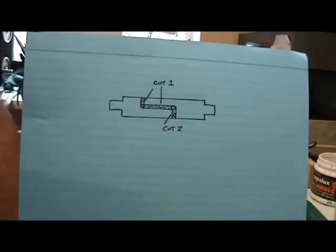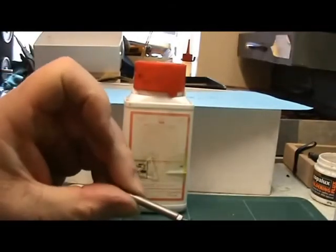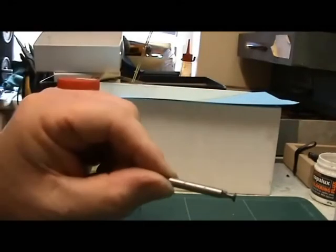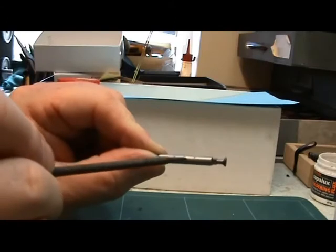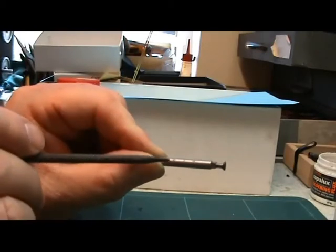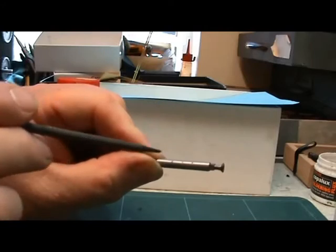Leave it to dry, then tidy up the whole thing, getting rid of any extraneous glue that might have wandered out of these holes. I'll show you how to do that later in the process. The first job is to get ourselves an axle and mark it up ready for drilling. I have one here already — just a piece of normal silver steel axle. Make three marks in it: there's the centre, and two marks either side, five millimetres either side.